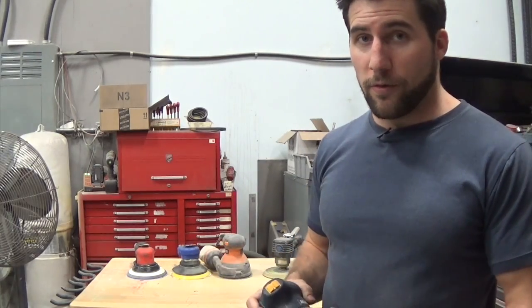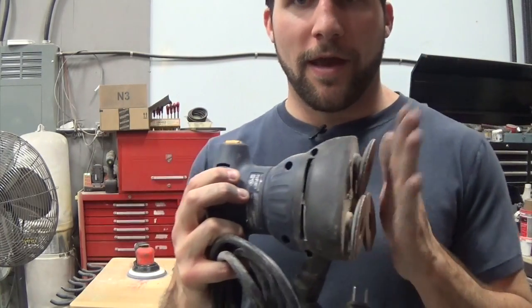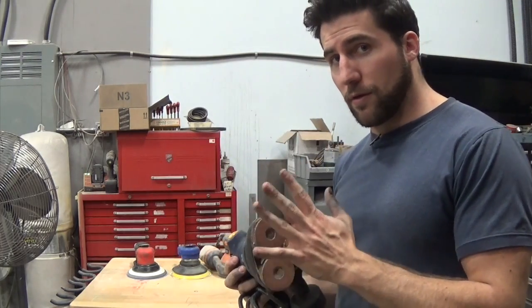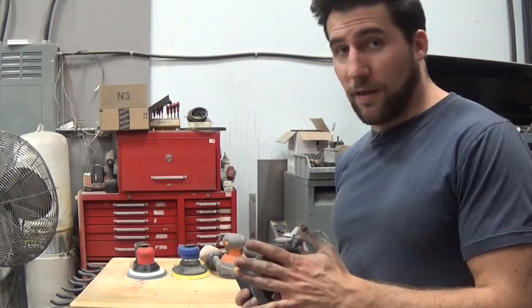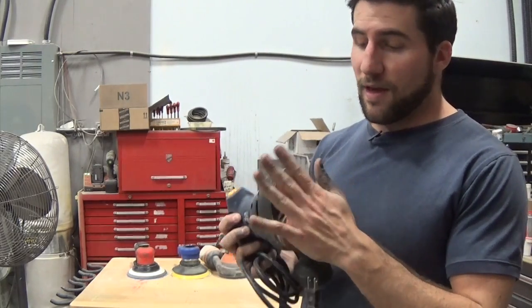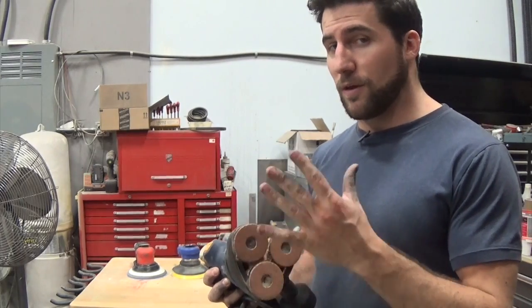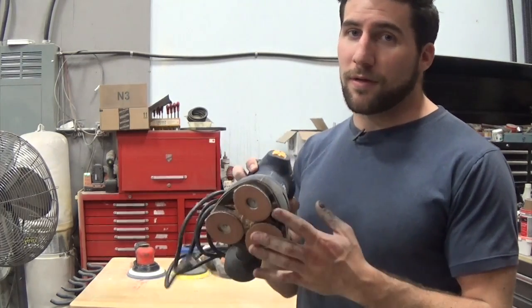Next — I'm not going to lie, I don't know what this is called. This sander has three rotary pads on it; they can flex a little bit to match up to a surface and they spin aggressively. These are going to tear away at material pretty quickly. You can get polishing pads for these for polishing metal and whatnot, but because of the aggressiveness and size of these surfaces, it's not very good for finishing work. You wouldn't catch me sanding a finish with this or finish sanding a piece before applying a finish using something like this.